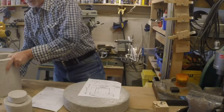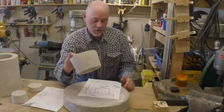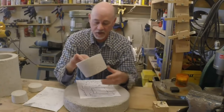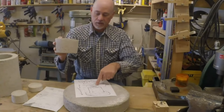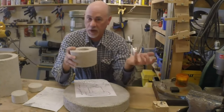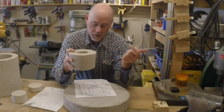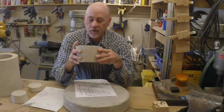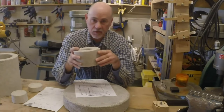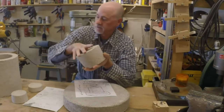So this is the chimney, or the vent, or an access point. It will sit in the cap up on top, right there. We'll set in the cap, and it will allow excess heat to escape. That way, the burner will work properly. But it will also contain it relatively well and give me a place to clean the dross off of the aluminum.